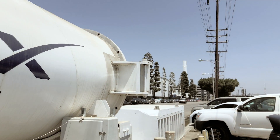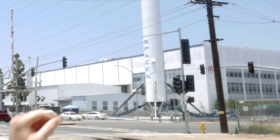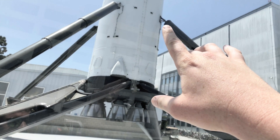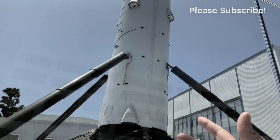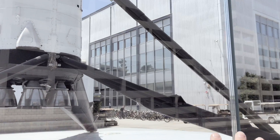There are four major components on the Falcon 9 landing legs. The first two operate pretty simultaneously: the latches on the top of the legs that hold the legs in place during flight, and the pushers at the base of the latches. The pusher would normally be found up here on the booster, but it's been removed on this one since it's not going anywhere anymore. The pusher would hit the landing leg, letting gravity pull it right down.